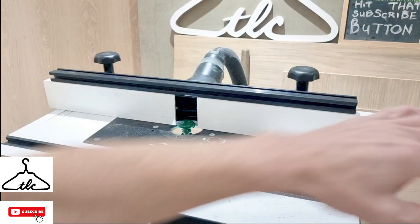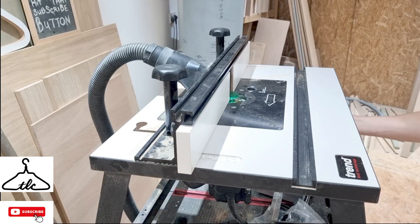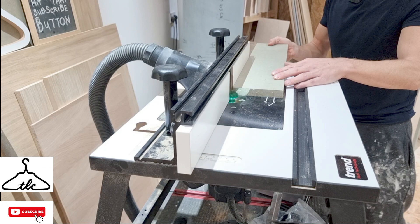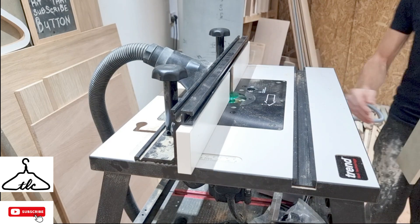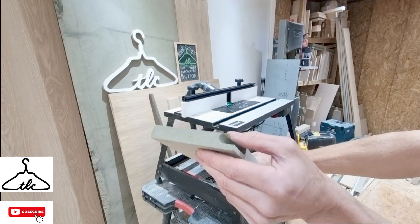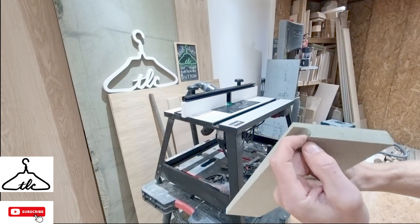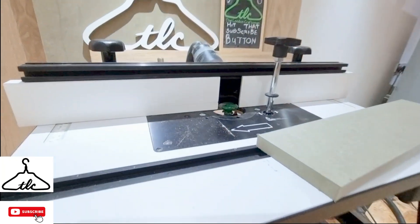Everything is nipped up and the router is attached to the hoover so it'll start when I flip the switch. I'll get my scrap and give a little test first. So this is what it produced — there's a little bit of burr left. We need a nice bit of meat there because that is ultimately where you're going to be pulling the door open. That's the front of the door, that's the back — and that lip is far too thin. We need to leave about 3mm on that tip, which means we need to raise the cutter.